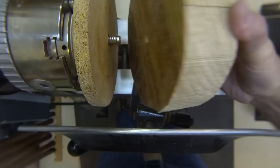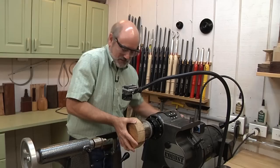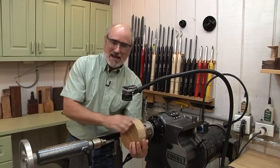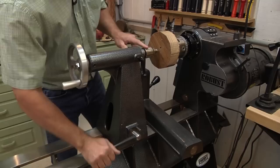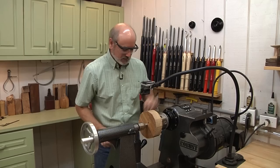On to the lathe. We've got our chuck with our spacer and our worm screw on here. We're going to take the center hole and put it in — that is the top of the base. I'm spinning my headstock and you see that screwing in good. One trick: when it gets really tight, lock your headstock in and then use both hands to turn it even tighter. That is a fantastic hold. Just to be safe, we're going to bring our tailstock up with a live center in it to give ourselves a little more support. I've got my tool rest at center height.